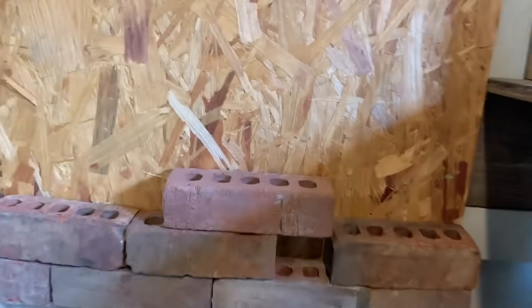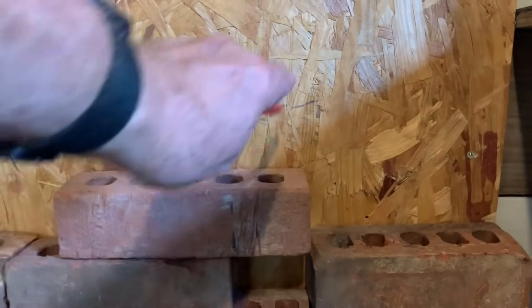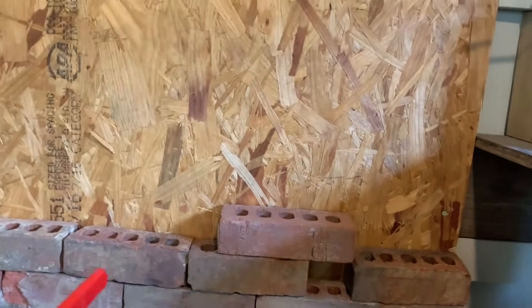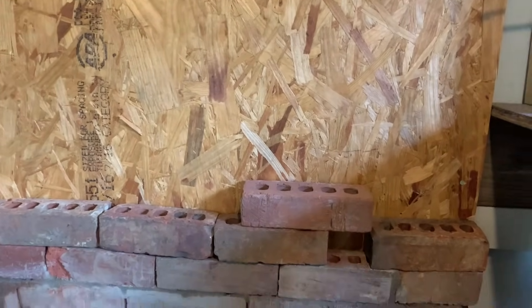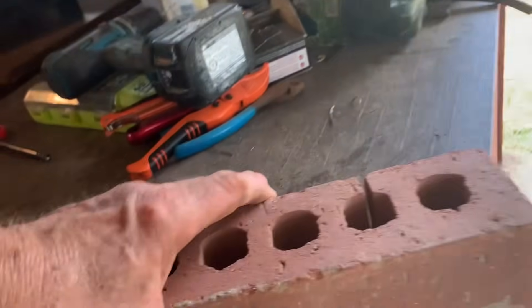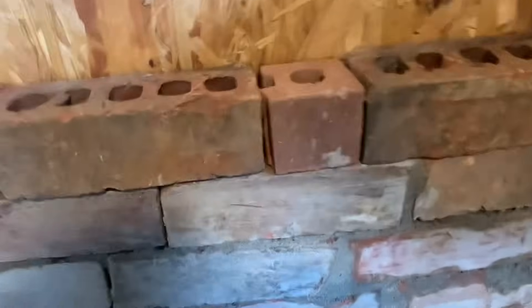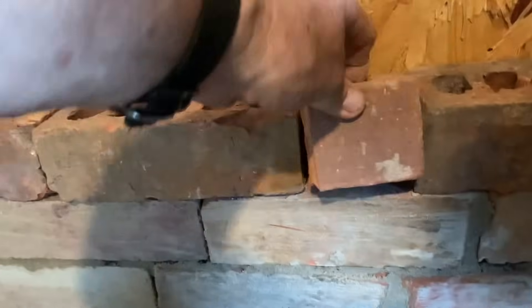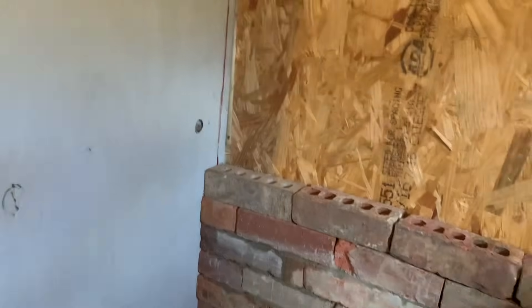I'm going to bring it up to about right here. Probably my next row, and I'm going to put some clips in it tying it to this wall, plus glueing it. I glue every third row to the wall, and that's going to make sure it doesn't want to try to fall or come over. You can see I'm cutting that brick — cutting it with a skill saw with that kind of blade on it. It's made for metal, but it's cutting a brick. I'll cut it on the back side and it'll be ready to go in place. The piece I cut off feels just perfect, and this piece here will be sharp — I can start it off in this corner for the next row and it'll be staggered.